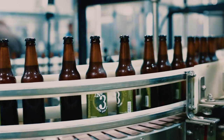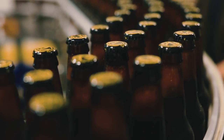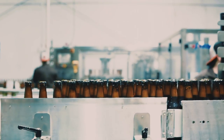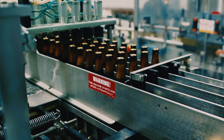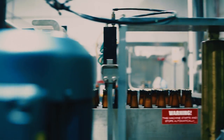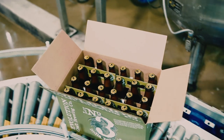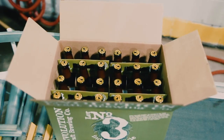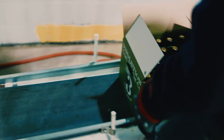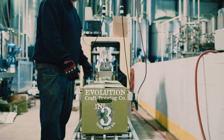The labeler is going to apply one label to the body section of each bottle and then feed it into our drop packer. The drop packer drops the bottles into a box. If you look down the conveyor line it's almost like a horse track — there are four lanes. Each of the bottles are put into those four lanes and when there's four lanes wide by six bottles deep, a conveyor lifts up the box, the bottom basically drops out, and the bottles drop into that box. The box then falls back to conveyor height and now we've got a full box of 24 twelve-ounce bottles full of beer with labels and crowns. The last step on the packaging line is to pass through a case sealer before one of our employees removes it from the outgoing conveyor and begins the palletization process.